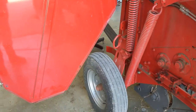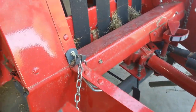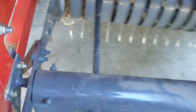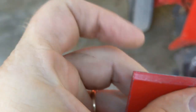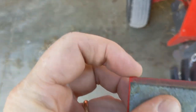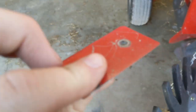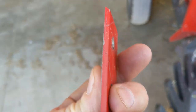A few of the things I had to do: I've already removed the knife that's under here, and we'll show you when we go to put it back on. They're not very sharp to begin with — you can run your finger along it and not get cut. Plus they paint everything. This one even has some damage or bluntness right there. So what we're going to do is hone this on some emery cloth, get the paint off, and sharpen it.